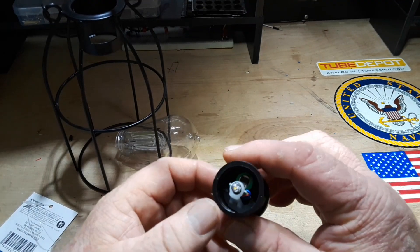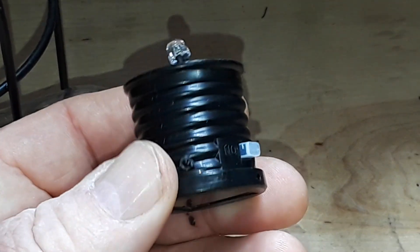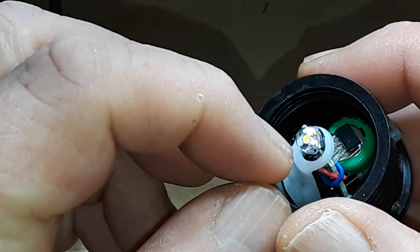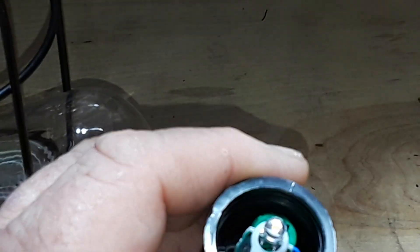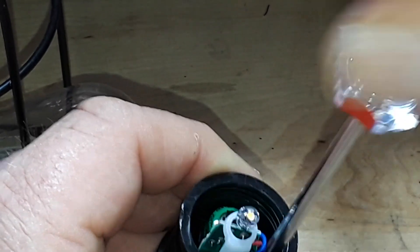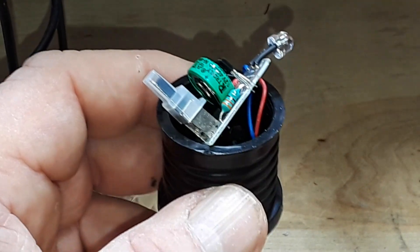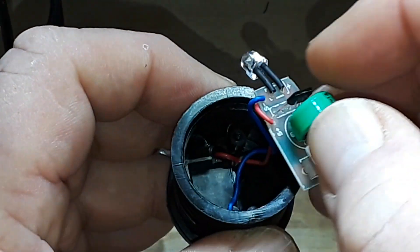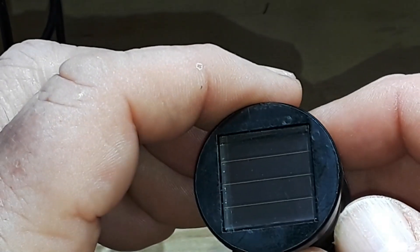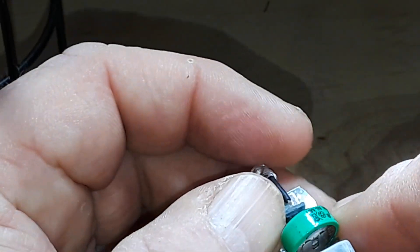Let's take a look here. Let me get some more light and zoom in. This is the actual unit — you can see we have a little LED there, and it's being held in place by this white plastic cover. I removed the plastic stand, and now we get a look inside. You can see there's simply two wires going to the solar panel, and they come back and feed this little tiny four-pin chip.